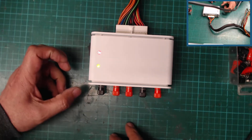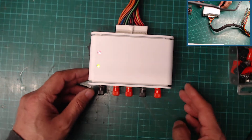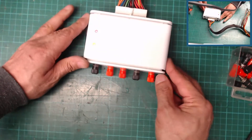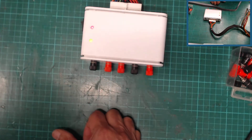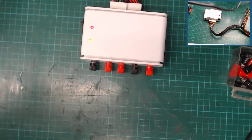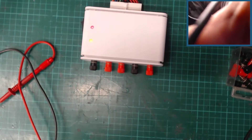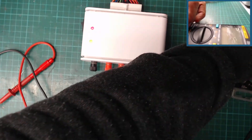I'll put a resistor in there for a load, as some power supplies need a load. Then I just made holes and connected those in there. I'll just show you — at the moment you can see it's on. Let me just get a multimeter and show you that you can plug anything in there and get the voltage. Let me get this other camera on the multimeter so that you can see what is actually going on.